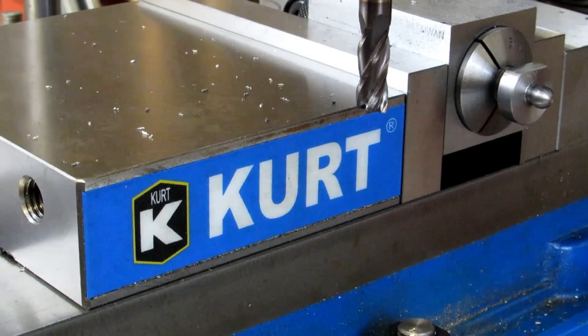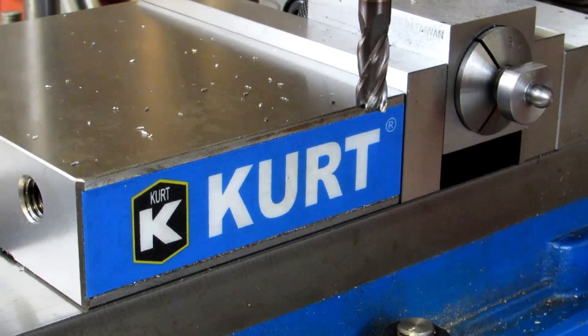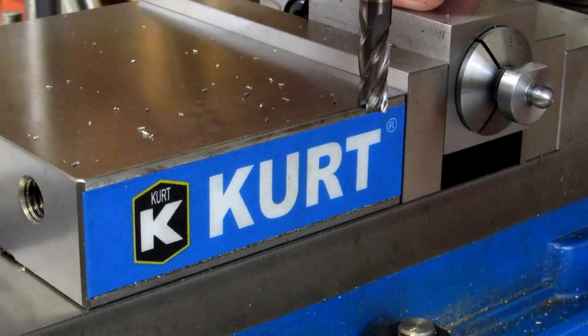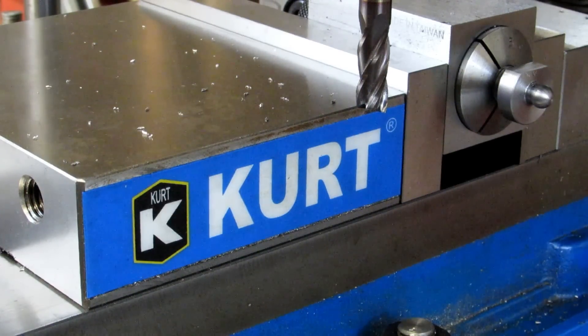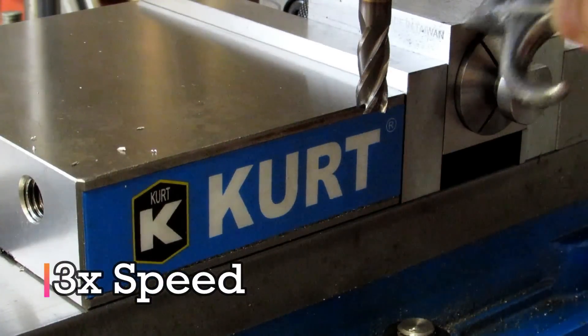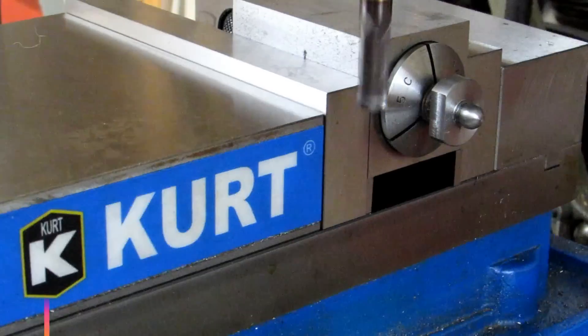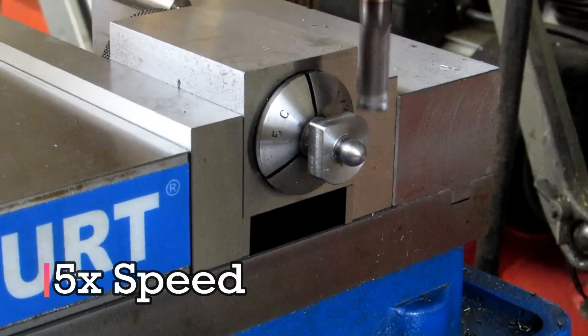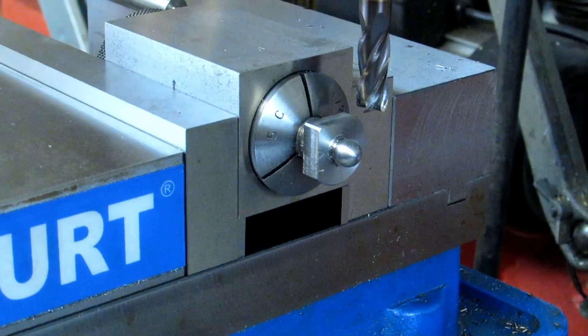This square should have a pretty large tolerance — there's no reason for it to be tight at all. It's not rotating quickly so balance isn't an issue, and the only thing it'll mate with is a wrench, which is usually larger than nominal anyway. So I can take the block out, flip it to the next side, and make the same cut at the same Z setting for all four sides — I'll be somewhere near 5/8 of an inch square, certainly close enough. Also, the reason we pre-turned it to 850 thousandths was so the corners are already knocked off and we won't end up with a sharp corner we'd have to hit with a file later.